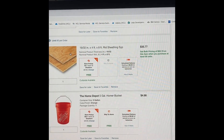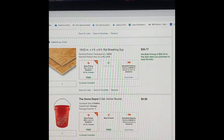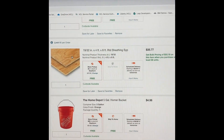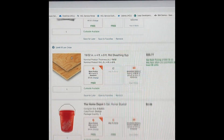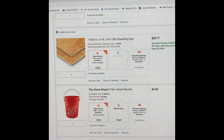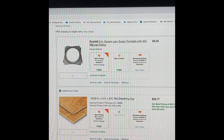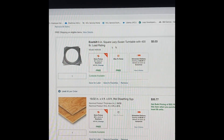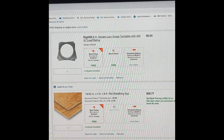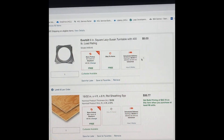It's a 4x8 sheet. When you're in the big box store, have them cut it right in half so you get two 4x4 sheets. You're going to only use one of them — buy it and you've got other things you can use, because you're going to use this once or twice and then tear it apart and use the lumber for something else. You're also going to need a lazy susan. The big box store has one with a 400-pound load rating, six inches square, and it's five bucks.